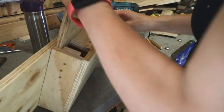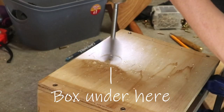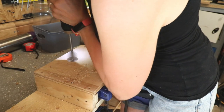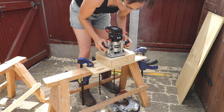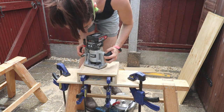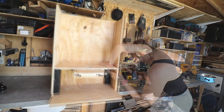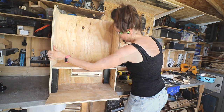This is all upside down still. I pushed the lever closed and clamped it so it didn't move, but because I've got a box inside here I drilled an access hole so I could slot my router in and remove the excess with a flush trim router bit. Then I could screw the shelf into the frame, although later I felt this mechanism was in the way of him eating straight out of his bowl, so I did raise it eventually.